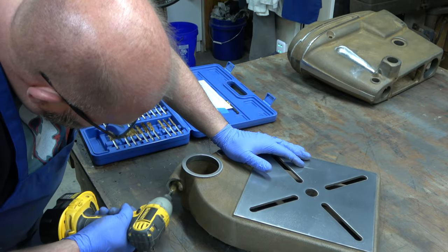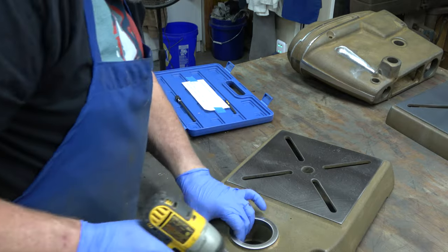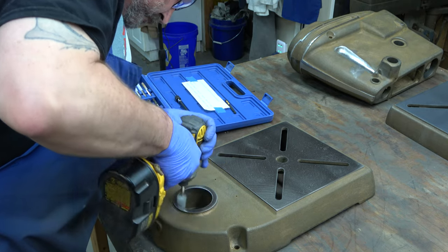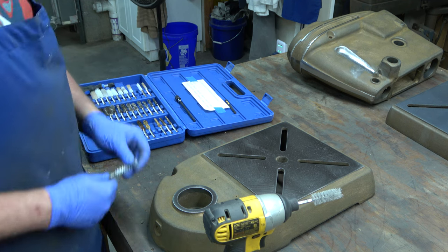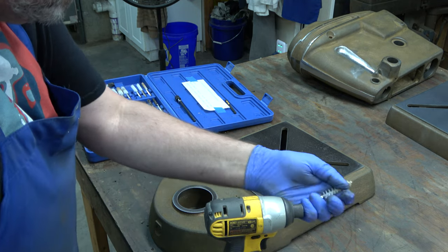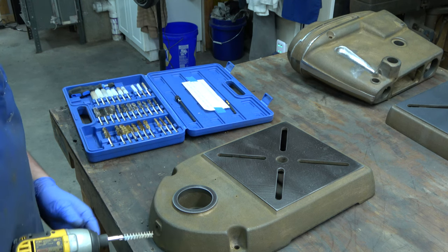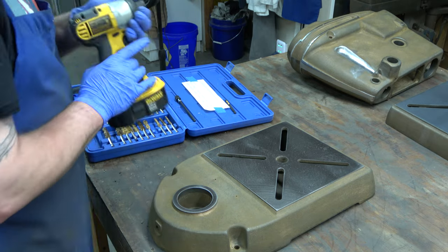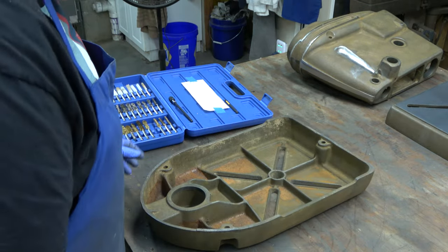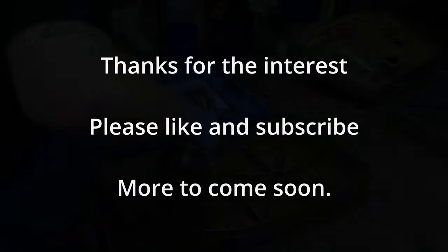Just like that — super easy. And then we'll do the same for the base. I clean out all the screw holes that are in the head casting and the base as well. I just use the nylon brush for that — I don't want to mess up the threads or anything like that, I just want to get them clean. That will pretty much wrap up part six. Part seven coming soon. I hope you found this helpful and you enjoyed it. If you did, please like and subscribe. I appreciate all the support and I will see you next time.